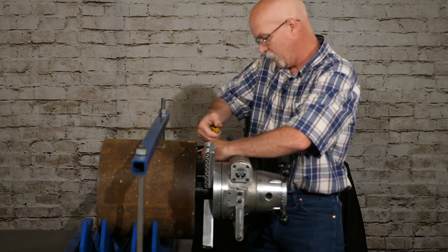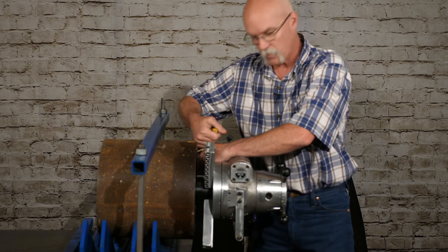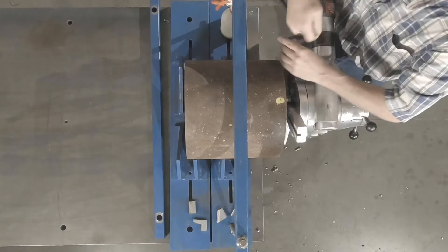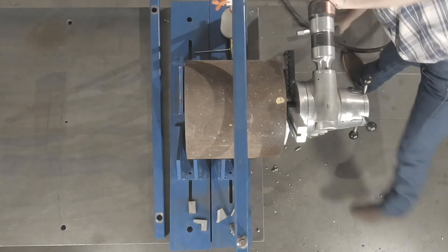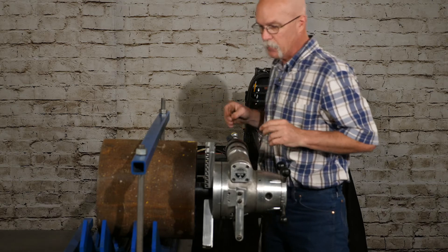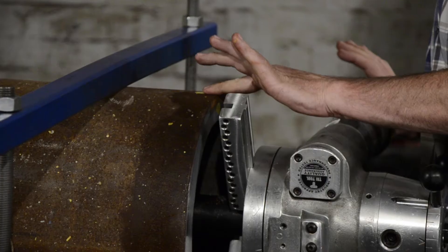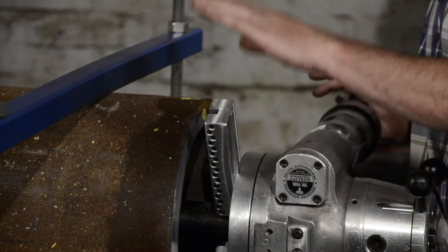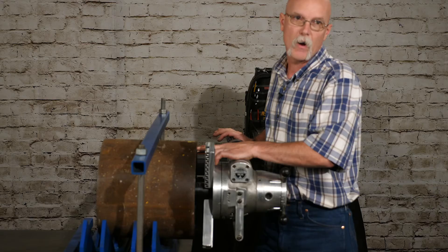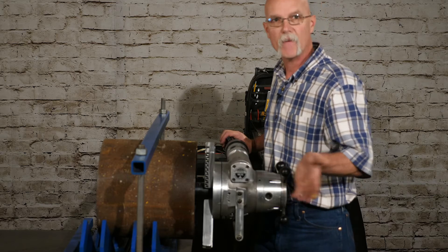So if you're doing all three procedures at once, you would go face, counter bore, bevel — and always have the bevel bit in the steel block. But we're doing individual steps today, so I'm going to always use the steel block. This machine is rated to do a maximum of 3/8ths cut depth. So what we're going to do in steps is take our 3/8ths and push it all the way back to the top of that punch mark, keep going down until we hit an eighth of an inch away from our 3/4-inch transition punch mark, then we can put our 37 and a half on and we'll be finished.